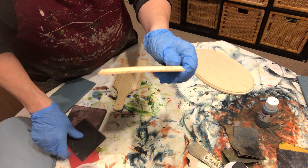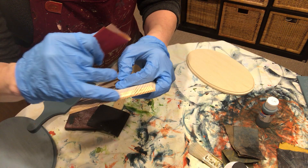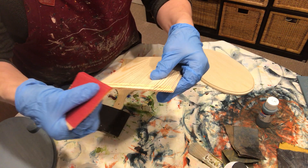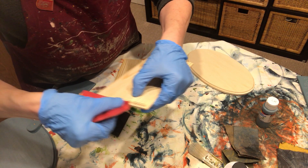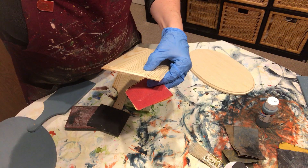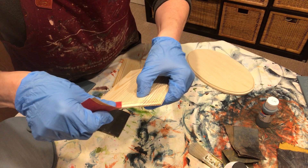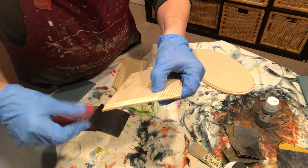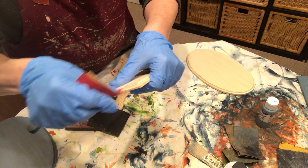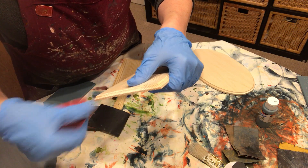On this piece I'm going to take a piece of sandpaper that's rougher and coarser. The coarser it is, the better for taking down these rough spots. This is a 220 — you can do a 180. I have it folded in half so I can get into the edges. I want to just work back and forth and sand down these rough edges. It's time consuming, but it's also kind of gratifying and relaxing. You're on a mission as you're working on sanding these pieces.